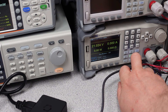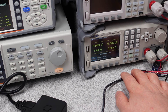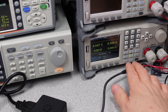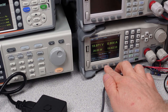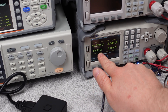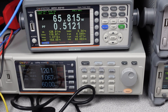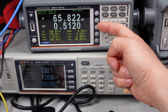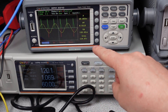This power adapter also has an adjustable output voltage mode called Programmable Power Supply, or PPS, which can help devices charge more efficiently and therefore faster. The adapter has a 21-volt PPS mode with up to 60 watts but only 2.85 amps, meaning Samsung fast charging is on the menu but only up to about 25 watts. At full load, the adapter supplies its 60 watts rated power with no problem on the DC side. Switching to the AC side, the first thing I notice is that it lacks power factor correction. It all comes down to that efficiency claim.